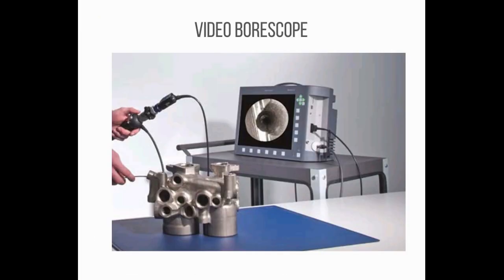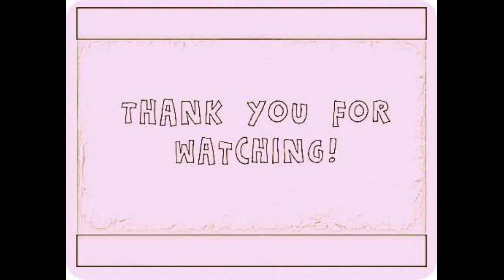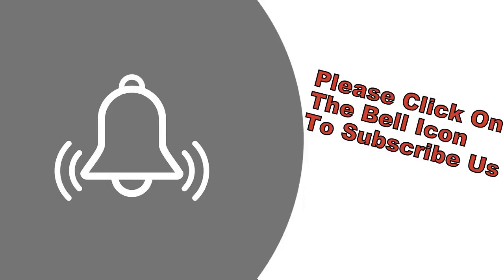Number 25: A Borescope, occasionally called a buroscope — though this spelling is non-standard — is an optical instrument designed to assist visual inspection of narrow, difficult-to-reach cavities, consisting of a rigid or flexible tube with an eyepiece or display on one end, an objective lens or camera on the other, linked together by an optical or electrical system in between. The optical system is in some instances accompanied by fiber optic illumination to enhance brightness and contrast. An internal image of the illuminated object is formed by the objective lens and magnified by the eyepiece which presents it to the viewer's eye.